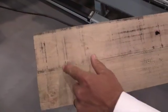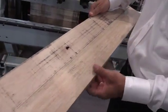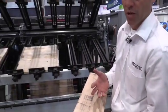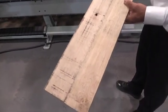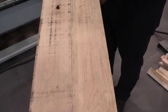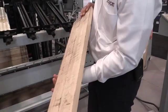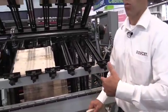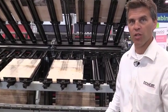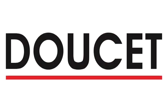Instead of big glue excess and drips, this is the typical controlled glue output you get with this type of applicator. You can see there's no excessive glue — everything is in the right place. As we have controlled the glue application process, the right amount of glue has been put in the joint, leaving the surface as wood, not glue on top. That also simplifies the stacking process when coming out from the clamp carrier — you can right away stack pieces over each other without putting sticks between them or using sawdust to prevent panels from gluing together.